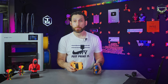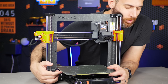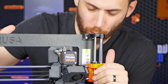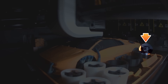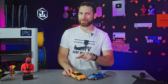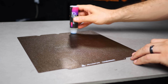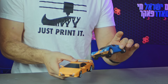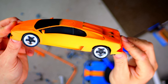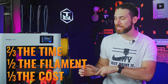I actually just left the printer running over the weekend while I went up north to my in-laws, which is honestly a level of trust reserved for a very select few machines in my farm. The only issue it had was a slight bed adhesion problem on one of the difficult parts — the tire. I don't think I ever actually got around to cleaning the build plate, but after this I just applied Magigoo and that resolved any future bed adhesion issues. If you ignore the filament transparency issues and the ugly layer lines caused by the crazy organic shapes of these sports cars, these are two seriously impressive 3D prints, completed in two-thirds of the time, using half as much filament, on a printer that costs one-third as much as the industry flagship.